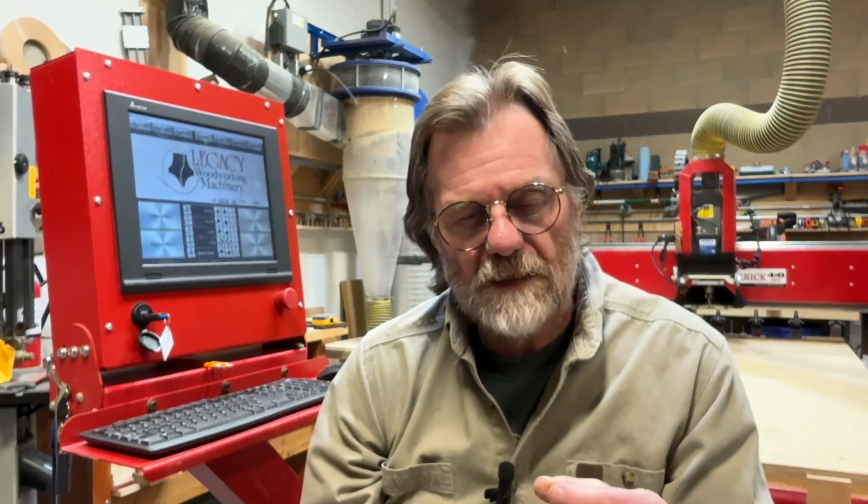It has two parts with a little spring in between, holding the shaft that goes into the tool holder from this little locating pin that's on the end. That pin rubs against my part, and I'll be able to find the exact edge, or within 1/1000th of an inch, using that edge finder. So that's what we're going to be up to today. Hang on, we're going to have a lot of fun.